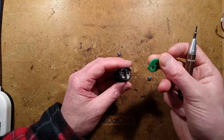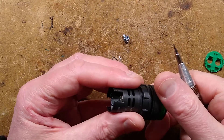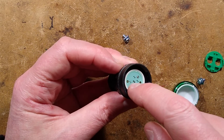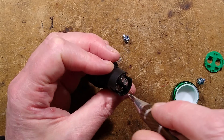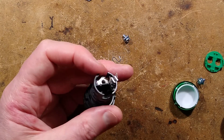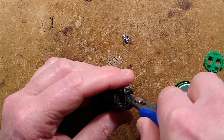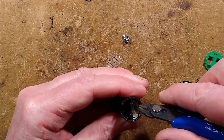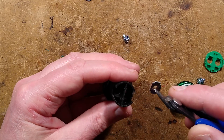So the construction: you've just seen me pop the end off and take out a screw with a little clamping plate. Inside the front is a diffuser and then a little dish — I'll show you a close-up picture because a lot of the circuitry is integrated onto that, not that there's much circuitry. These little plates are soldered in situ — they basically put a wire up and stick the soldering iron down and melt it in situ. There is a little clamp and another one underneath the little threaded bit that clamps everything together.